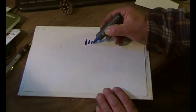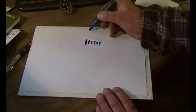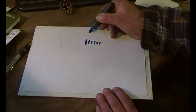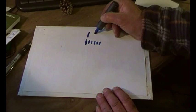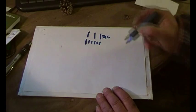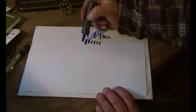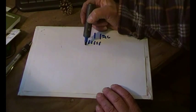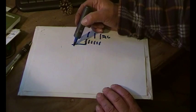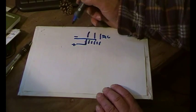We've got a rectifier, and from the turbine, which is 3-phase AC, so it's a brushless 3-phase AC generator at nominal 48 volts, you've got 3 wires, and that's the AC. So out of those 3, out of the rectifier, then you have a positive DC, and let's take it from here, a negative DC.